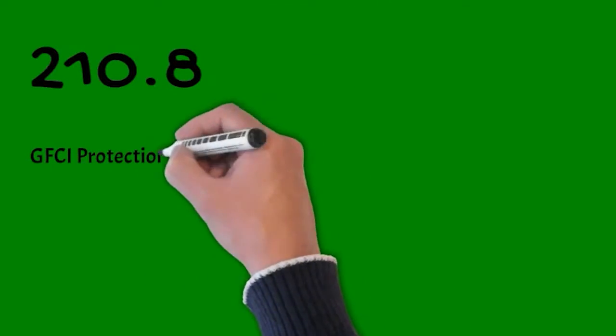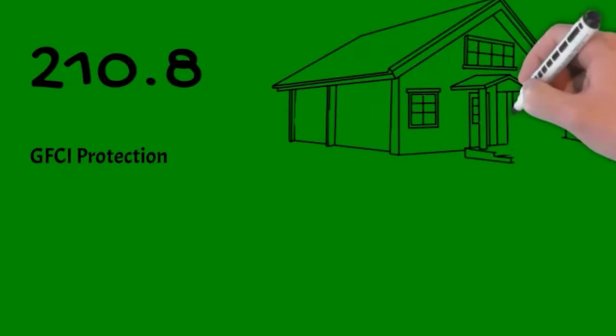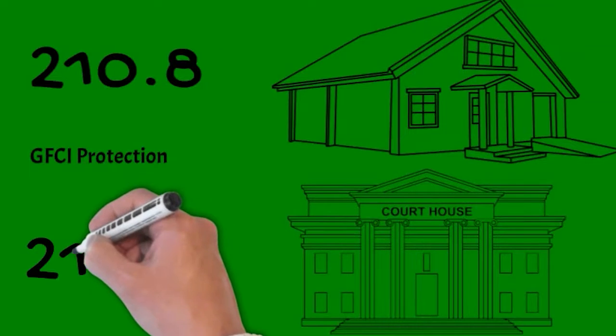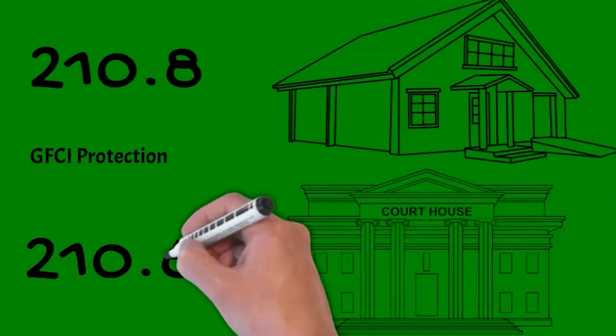I just got done installing an eight-foot LED fixture in this basement — super excited about the LED technology, it's easy, efficient, and lower maintenance. I haven't had to change out any of these integrated fixtures since they came out, so time will tell. This is a great time to talk about the code of the week: every week we'll memorize a code article, and this week it is NEC 210.8. All you have to remember is GFCI — anytime you want to learn about GFCI protection anywhere in a residence or commercial setting, it's blanketed under 210.8.